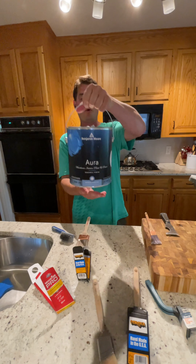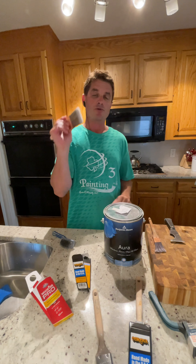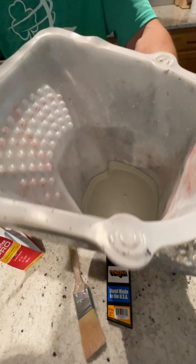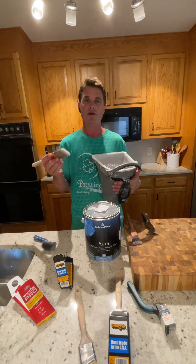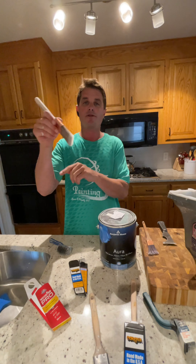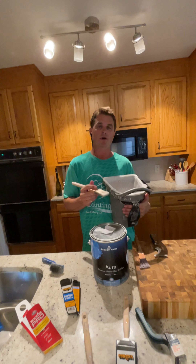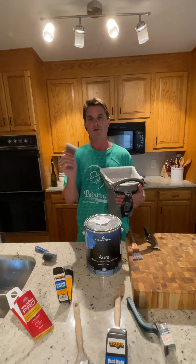I already have some paint in here. The paint we're going to work with is Benjamin Moore Aura in the color 'Flower Jar.' With a dry brush, I only put about an inch or two of paint in my cut bucket — that's very important. Never pour half a gallon in; it's unnecessary. If you dip too deep you'll have loaded up half the brush, which you don't want. You just want to load up the bottom third of the brush. Now we're going to go to a different room where I'll demonstrate how to dip, tap off, and transfer the paint.